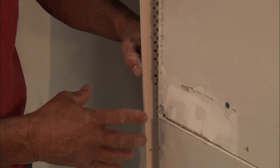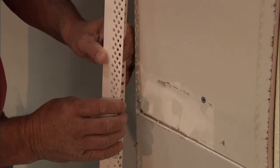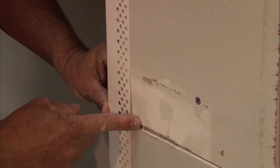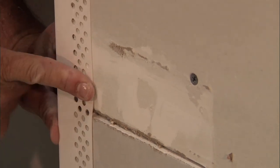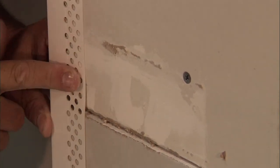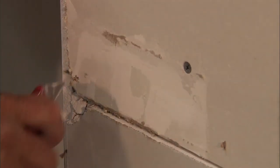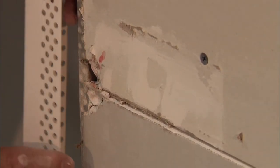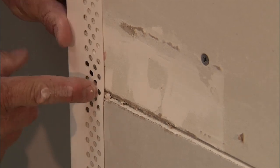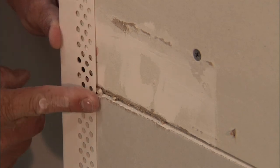In the real world, hanging isn't always perfect. It's very important to have this pliable flange so when you put it over hanging that doesn't line up, it will actually lay down. It's pliable enough that it will follow the imperfections of the drywall. To make it a real-life situation here — when you put this thing on, you see there's nothing but air under there. With these holes and the pliable flange, it will follow the contour of the drywall.